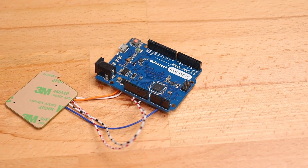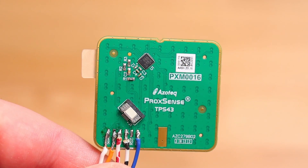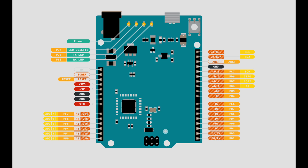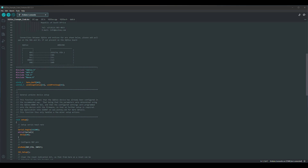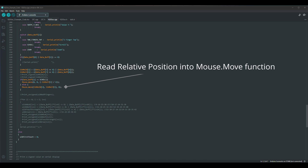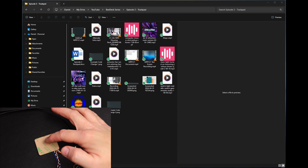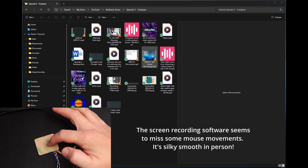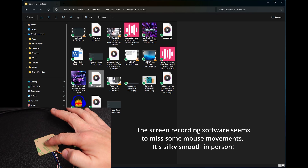Since I can't test my trackpad design without the programmer, I turned my focus to testing the TPS43 instead. Azotec provides some sample Arduino code which works wonderfully to read the sensor data. For anyone trying to get this running on an Arduino Leonardo, you'll need to change the pin used for the ready signal, because pin 2 is shared by the I2C connection on that board, which causes some really weird issues. I made some basic changes to the example code, including the Arduino mouse library and reading the relative x and y coordinates straight into the mouse move function, giving us a functioning trackpad with single-tap gesture tied to left click.